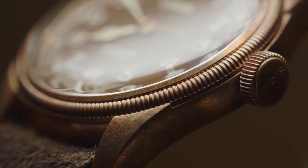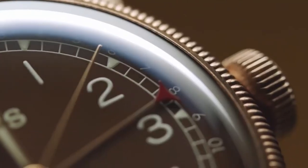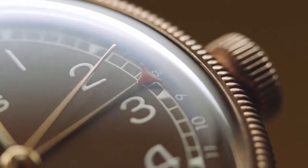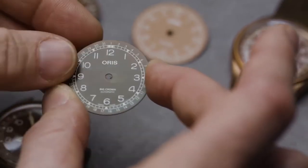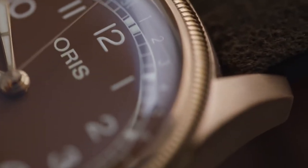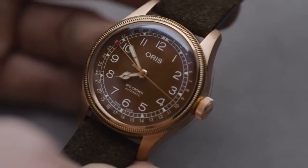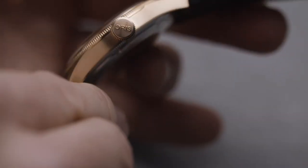We have to find a way how we're going to realize this — how we're going to have the oxidation on the dial and how we can stop the oxidation. If the oxidation goes too far, small pieces of the dial can get into the movement, and this can have the final reaction that the movement stops. So we have to produce a bronze dial where the oxidation is kept within a certain limit, and then we can stop the oxidation by a special process.